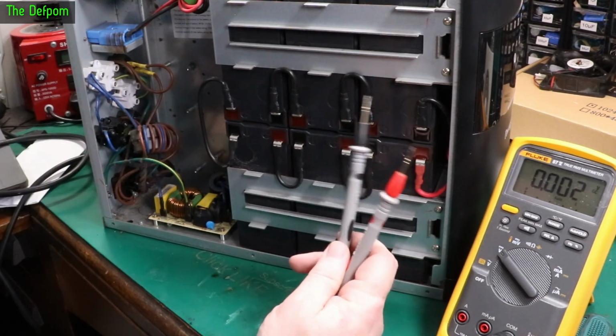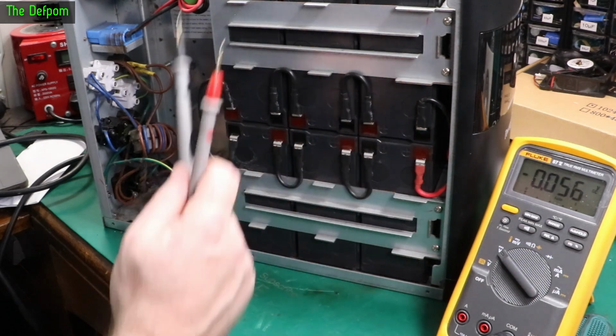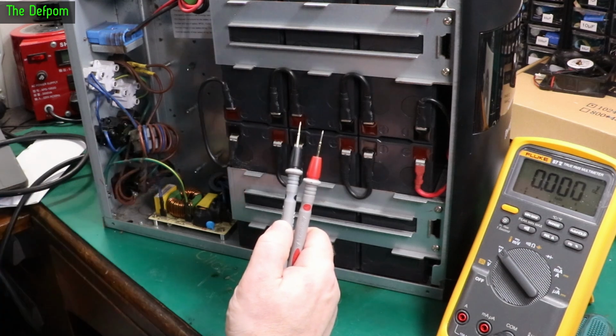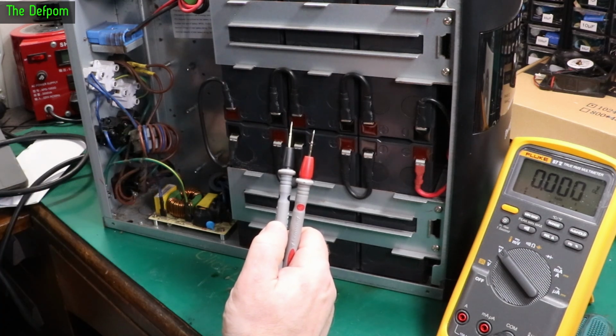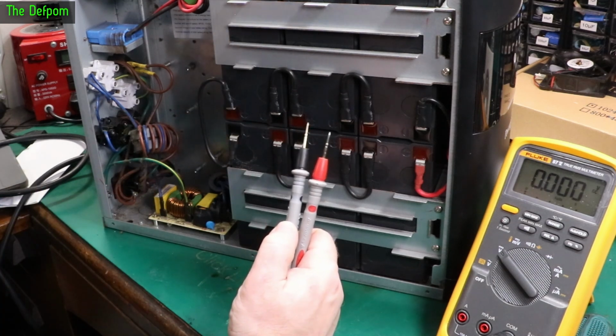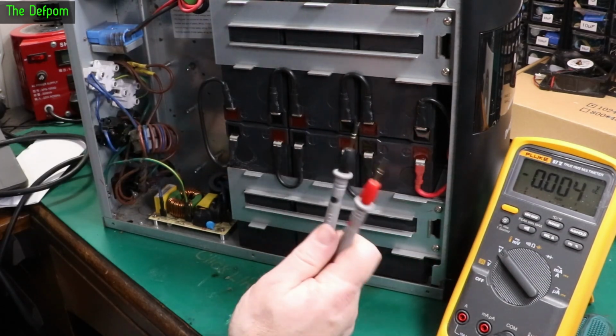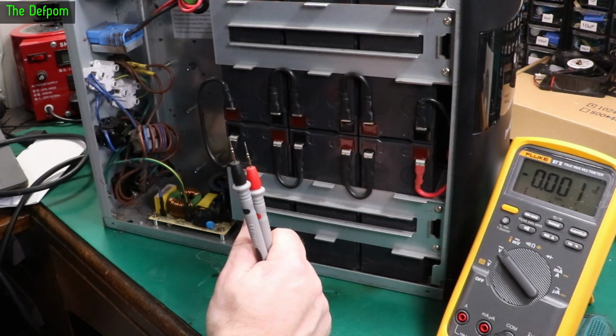You can actually get lithium iron phosphates in the same form factor, but the current rating is usually lower. They might be limited to 10 amps or something like that, maybe less. So it depends on the batteries, I think, but of course they have a BMS built into the battery pack. But also like 3 times the price. But they have about 10 times the lifespan.